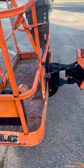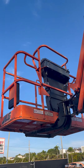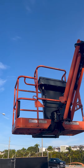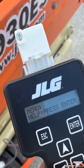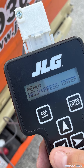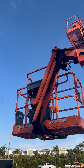Step 4: If the main boom is centered with the rear wheels and the DOS override switch has been activated to achieve movement, verify the state of the drive orientation proximity switch located under the turntable near the top of the hydraulic swivel. Step 5: The open or closed state of the proximity switch can be viewed with the JLG Analyzer. Go to the menu selection Diagnostics / Drive Steer / Drive Orientation Switch. It should read closed.